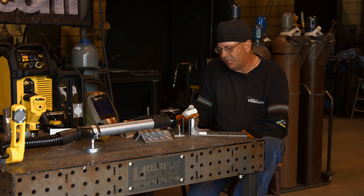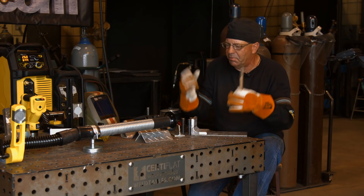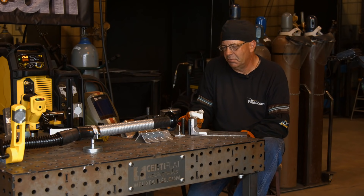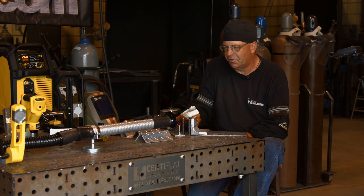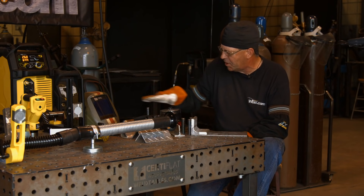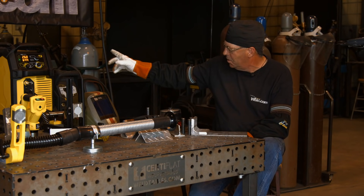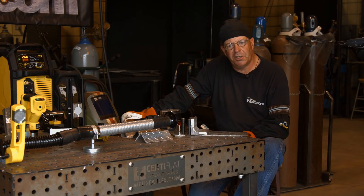I hope this helps. Somebody help me out - I'm kind of confused on this downhill thing. Do you normally do that on outside corners? Do you try to push them downhill, or do you go uphill? I've done about all of it. To me, this straight downhill thing would be okay for my work - if I was doing a toolbox for the back of a truck or a utility box. I also like this flat weld that we did - I thought we hit the numbers on it. A little confused on the uphill part, but the whole demonstration shows the capabilities of a spool gun: pure argon, Rebel 235 - hook and book, you can get some stuff done. Thanks for watching Weld.com, please subscribe.